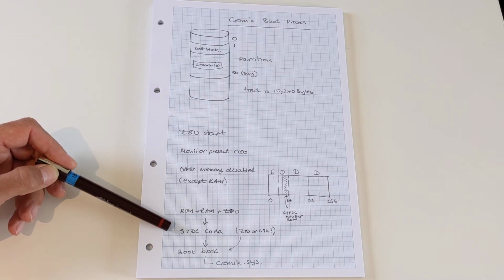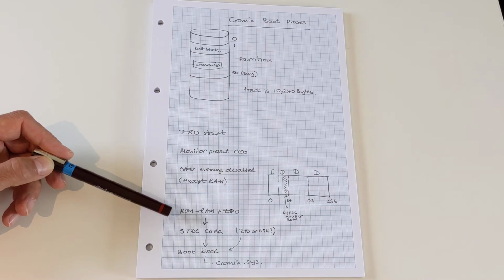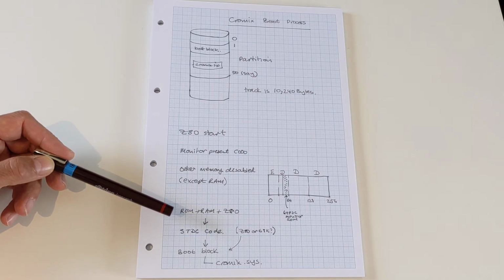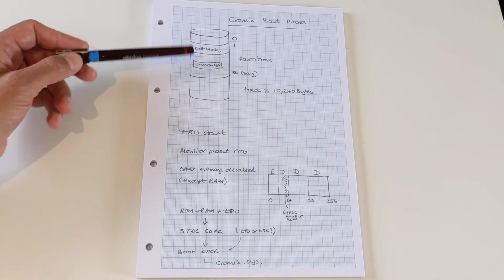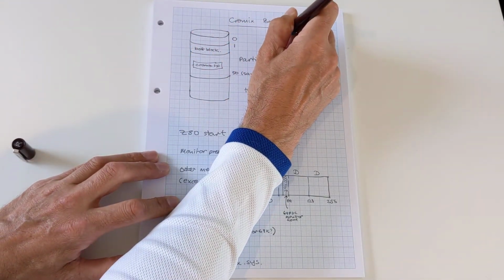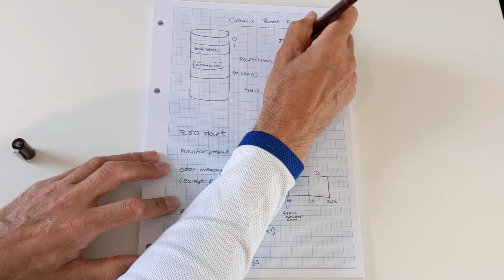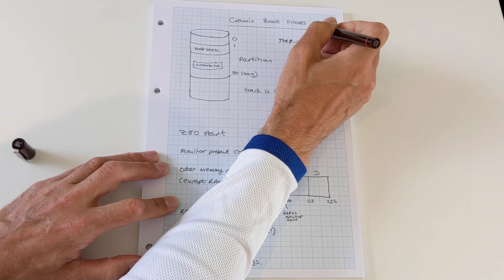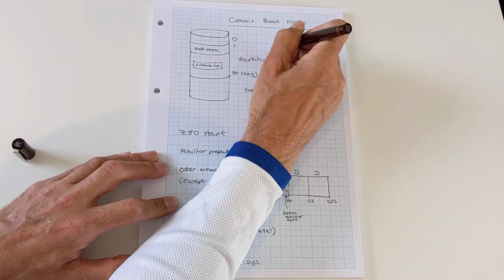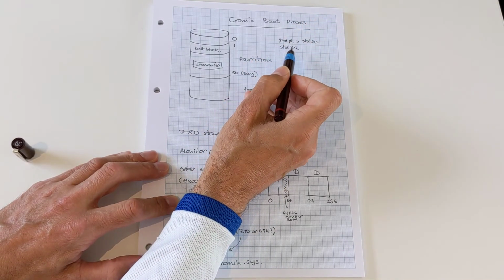And at that point you can issue commands, and the commands that you could issue would be something like BSTD0. So BSTD0 would mean B for boot, and STD0 would mean boot the 0th, i.e. the first partition on this disk. So the disks are numbered. A physical disk, the first physical disk on the STDC controller, goes from STD0 to up to STD30. So you can have up to 31 partitions, and there's a special STD which is STD31, and that's taken to mean the entire first disk.